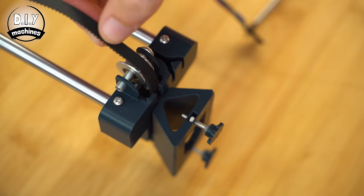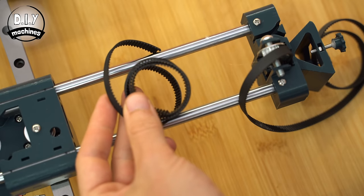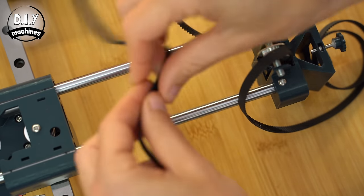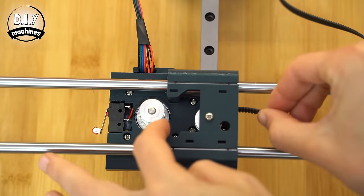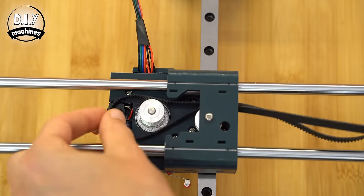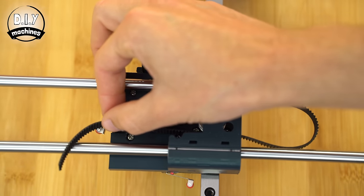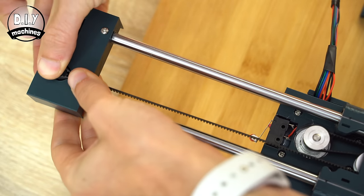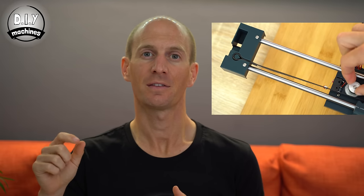The timing belt can then be laid back over the top of this pulley. To connect the Y axis to the stepper motor, take the 60cm long timing belt, fold one end back on itself and insert this into the slot at the pen end ensuring that the toothed side is facing inwards. Feed the timing belt through the tunnel in the main raft and then do a U-turn around the stepper motor's wheel. Feed it back out under the bridge, do another U-turn around the idling pulley and head back towards the other end of the Y axis. When you reach the other end, fold the belt back on itself so that its toothed side grips itself and feed it into the loop to hold it in place. This belt needs to be neither too slack nor too taut — turn the stepper motor of the Y axis by hand to check that it moves back and forth instantly when you change direction. If you're having to put too much effort to turn it with your fingers, your belt is probably too tight.